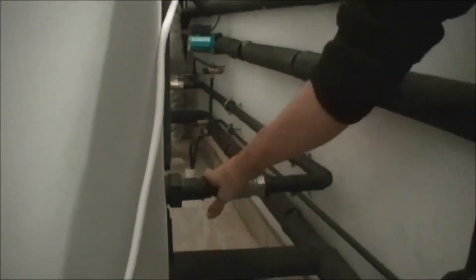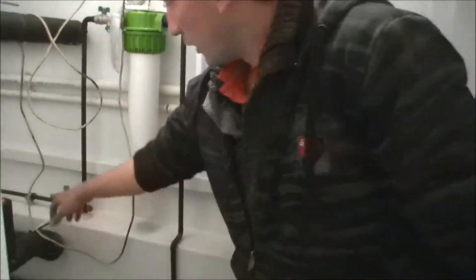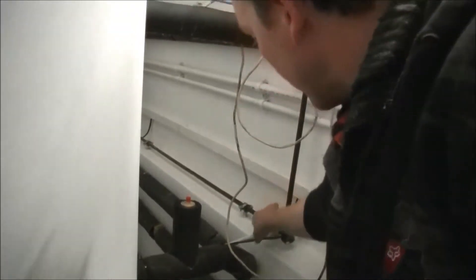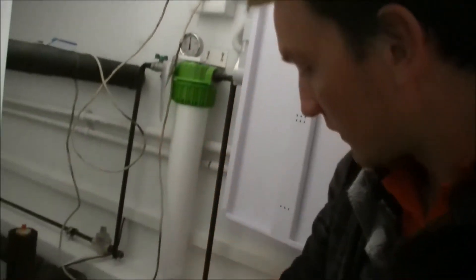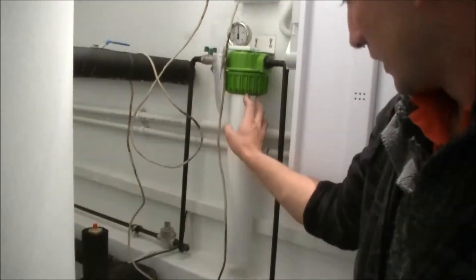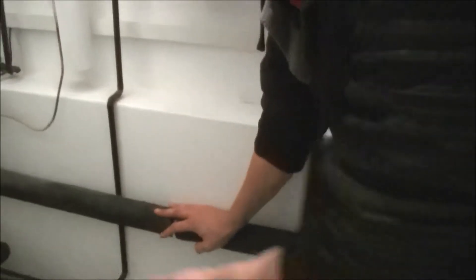Keeping your hot water system absolutely pure and causing a very long lifetime for your heat pump, because we're not putting any municipal water into the circuit that we're putting through the heat pump. Over here you can see a softening filter. Our municipal water comes in on the side here. We've got a pressure regulator that reduces the pressure down to 2 bar. It goes through a softening filter, and here you can see the pressure on the heat pump system — 2 bar continuously. Once the system is full, it will be full of softened water that continuously circulates to the heat pump and back through these 2 pipes to the heat exchangers.